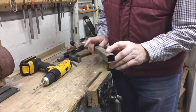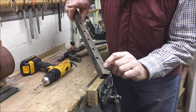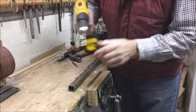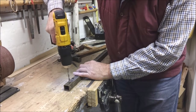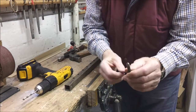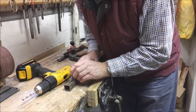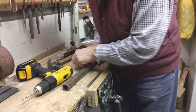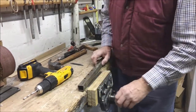So now I'm going to have a go at drilling this old piece of steel tube - it's a square tube shape. I've put a mark there where I want to drill. One of the problems with using a twist drill like this is that it's difficult to get it started exactly where you want - the drill tends to wander around. So the secret is to take what we call a center punch, which is ground very sharp steel. Tilt the center punch so that you can see your mark on the steel and give a couple of sharp taps with the hammer. So now we've got a little indent there which should make it much easier for the drill to start.